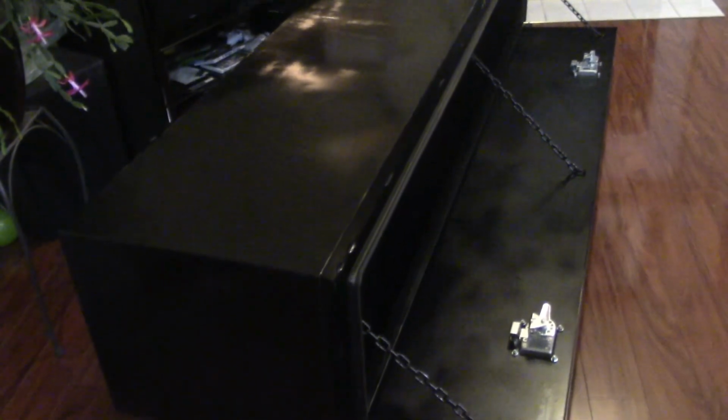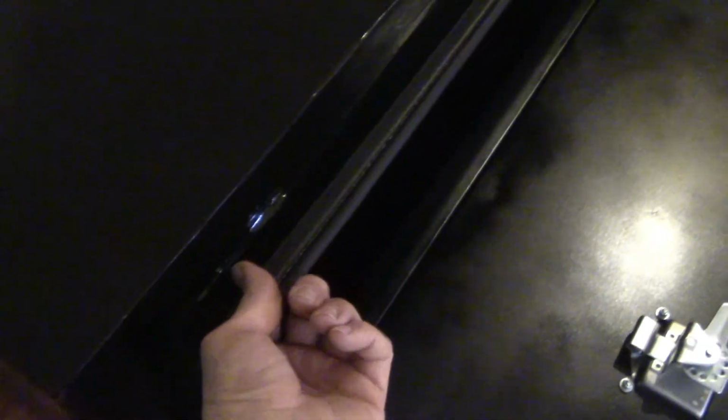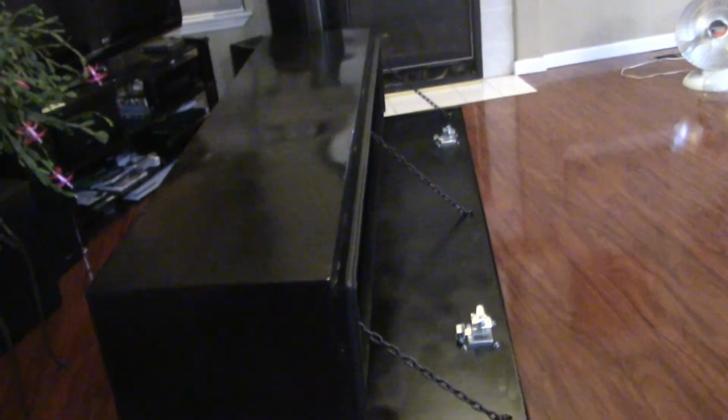So when I welded all the seams inside this box, again, I had to vary my voltage, as well as the thickness of steel that I was welding, because when you weld a seam 91 inches all the way down from end to end, and then from corner to corner, and then again from end to end, it gets hot in there and it can cause warpage. That was my concern, and it did cause warpage. It did on the panels a little bit, but mainly on the flat stock, because you had all this heat along the edge. I could see where the warping was happening, but it was unavoidable for me. Of course, if you guys have a better way of doing it, let me know how I could have done it, so that when I do my next box, I'll tackle it differently. But nonetheless, it's not something you really notice, especially with that trim lock trimming over it.